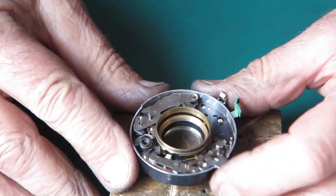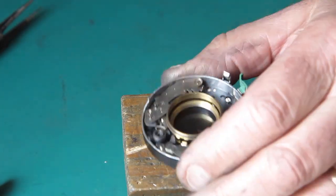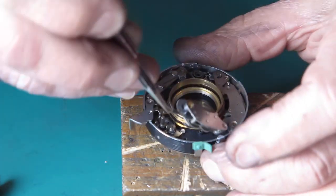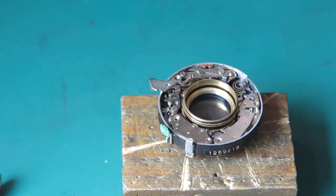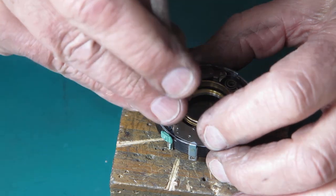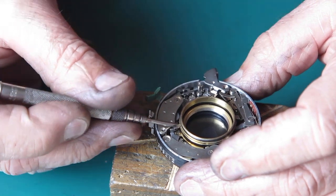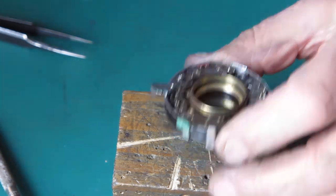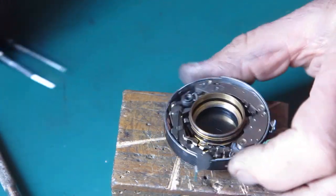Let's see what happens. That sounded possibly a little bit slow there. We'll leave it where it is for the moment and come back and adjust that. The self timer or delay action sits in the body here. That's held in place with one screw. Get that in position. Check that that runs down. That sounds fine. I'll just give them an extra good blowout in case there's a bit of graphite powder still floating about.